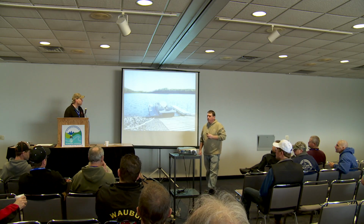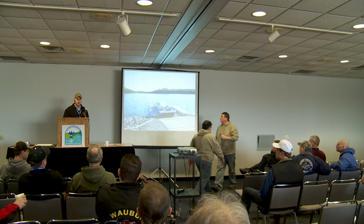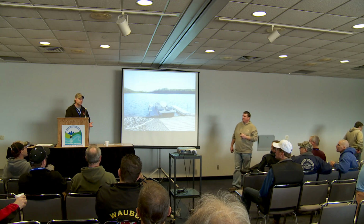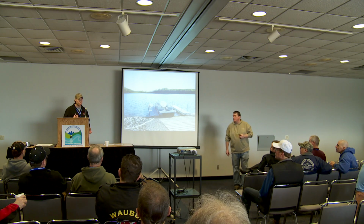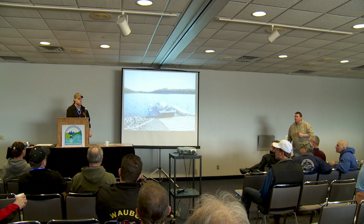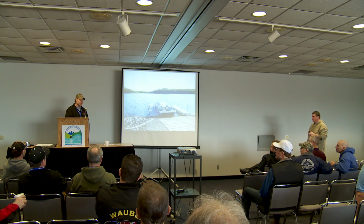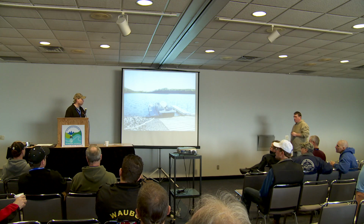I think the pump was fairly expensive, a couple $1,000, but it's a diaphragm pump. With the transfer pump, I was finding the impellers, even if you clean it, alum sticks so well to everything that you almost literally need to pull the cover off the impeller and wipe it down to get rid of it. This diaphragm pump we haven't had any issue with, because it's rubber. It's able to transfer the alum. We're able to then clean it out, and that's what we found works the best for us.